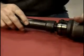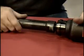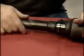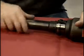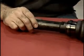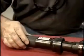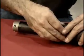As an alternative to torching, the optional collar cutter tool ensures clean, safe fastener removal. Attach the collar cutter thimble, just like the other nose assembly. Screw the thimble assembly onto the piston until the machined flat just disappears within the piston housing, just as you did with the nose assembly. Line up the Allen screw to one of the 4 grooves machined into the piston, and attach the half shells and true arc ring, making sure it snaps securely into place.